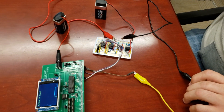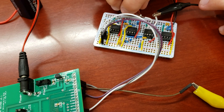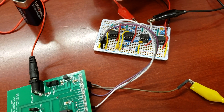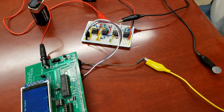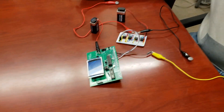Could you talk about the signal chain a little bit? Sure, so on the analog end the signal input comes in through here through the instrumentation amp and it goes through a series of low and high pass filters and gain stages that bring the signal up to a measurable level, detectable by the ADC and printable clearly on the TFT display. In the software I implement a low pass filter followed by a high pass filter to remove some of that DC offset, and then perform some derivative analyses that allow me to detect the QRS complexes and the heartbeat signal.